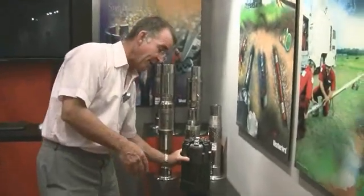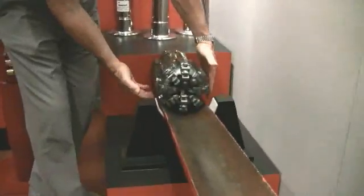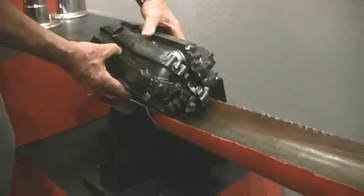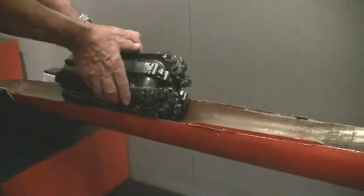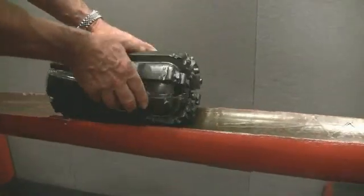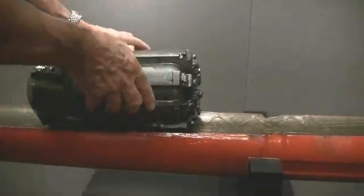I've got a bit here. Having locked the whipstock in the well, I will lower a bit down — and you can see now this bit will come alongside here. As I rotate slowly down, I'm milling the side of the casing. The bit is being pushed out; it's now halfway out. When drilling now I'm getting steel cuttings, and I'm getting some formation as well — steel and formation.